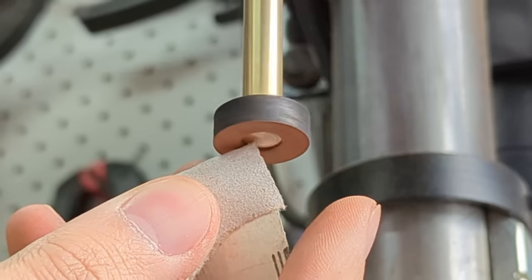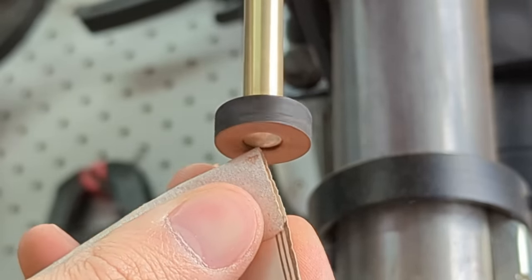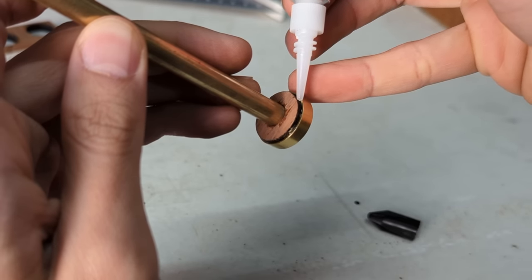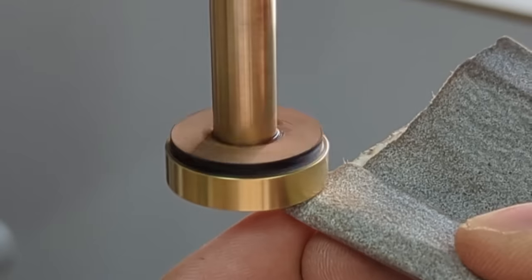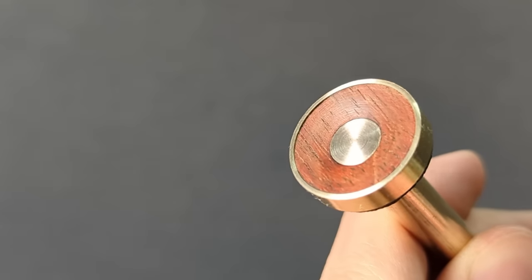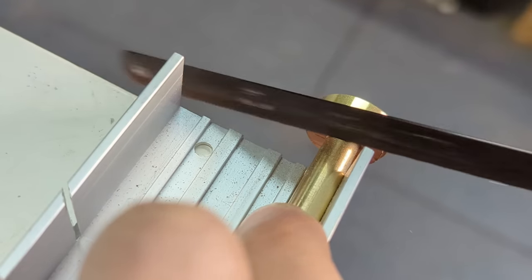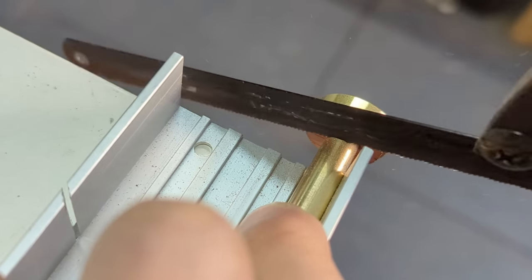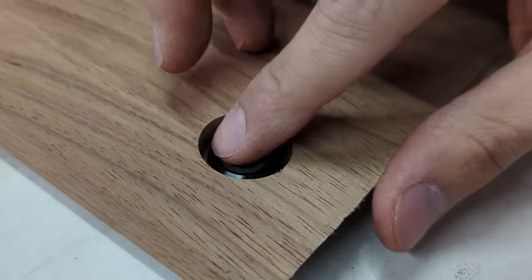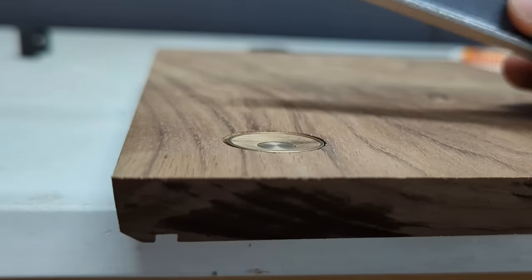The brass rod is glued 1mm inset from the wood so I can create a concave button, followed by an outer brass ring to add more detail. Excess brass rod is sawn off. And the stem is then filed until it creates a flush surface with the top panel.